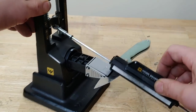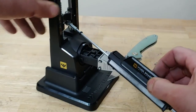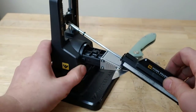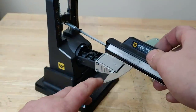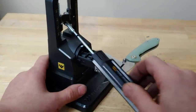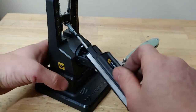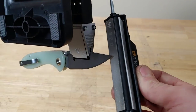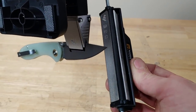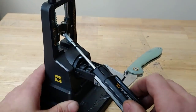Make sure when you're sharpening you don't go off the edge — if you do that you can round and chip the tip. Try to make sure you finish in the middle of the stone on the tip, meaning the tip finishes right there when you're going through the stroke. When going up and down, don't let the tip go off the edge or off the stone.